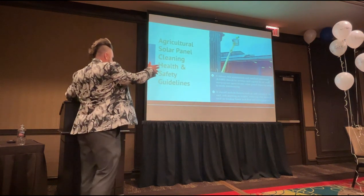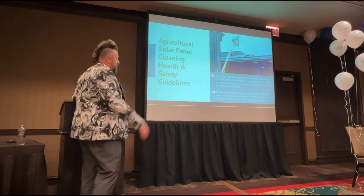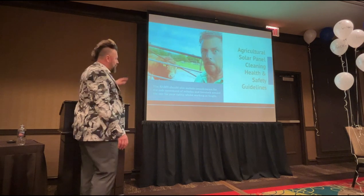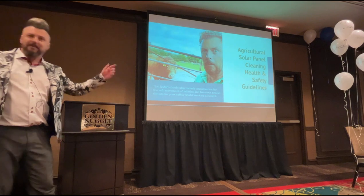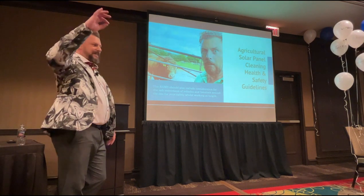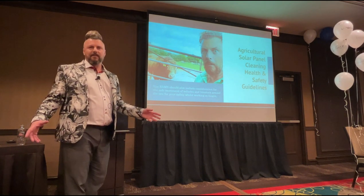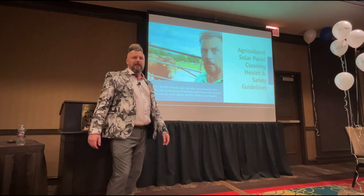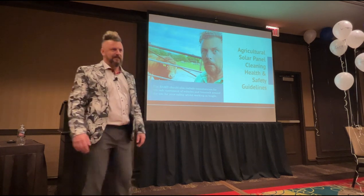So, robot risk assessment, you guys have got your unique name for that, so you need to make sure that you're writing that document out. Also, livestock on farms is a very unusual thing. You don't generally get this in offices and you don't generally get it at people's houses, but when you're writing out your hazard assessment sheet, you need to take into account, are they going to move livestock around my working area? You get a bull like that, nudge into your cherry picker, and that's going to wobble you around when you're 20 feet, 30 feet, 50 feet in the air.